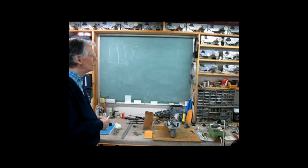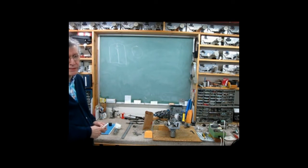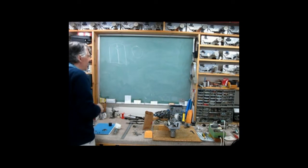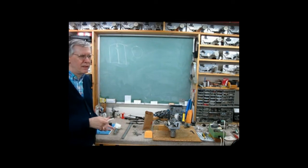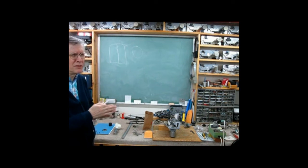And when you contour the tip radius on the drum, that's going to eat up another mil or 1.5 mils in the contouring process. And so you wind up with, after it's mounted on the shoe, and then you mount it on the drum and you line it up and you contour it, about 5.5 to 6 mils of usable tip. Well, you can't really use that, it's too much tip projection.